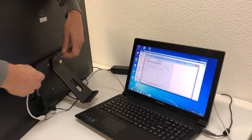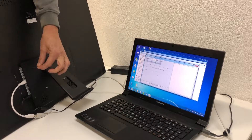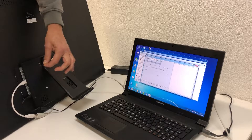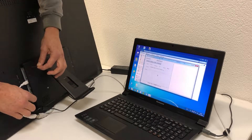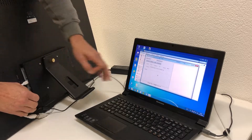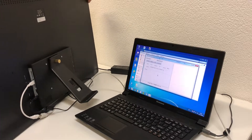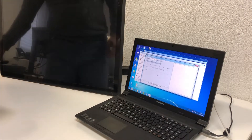To summarize: find the small reset hole at the back side, insert the pin and feel the small button inside, press and hold it, then plug in the power and keep holding for about five to ten seconds, until the message in the software says 'found one loader device' — confirming it is connected.